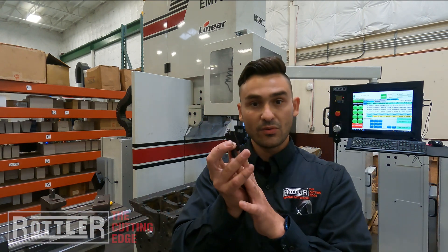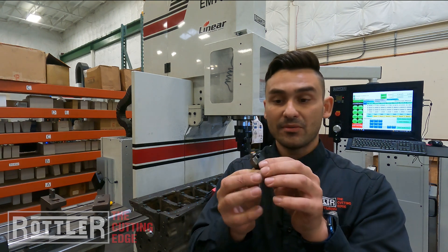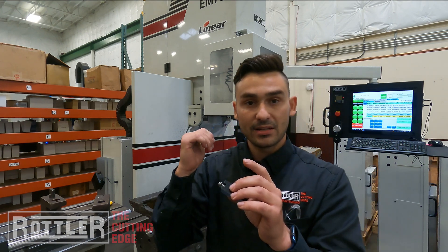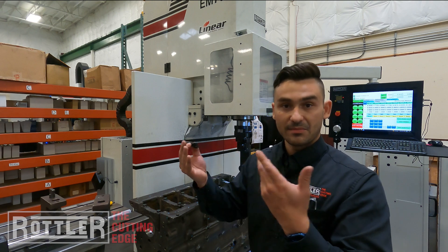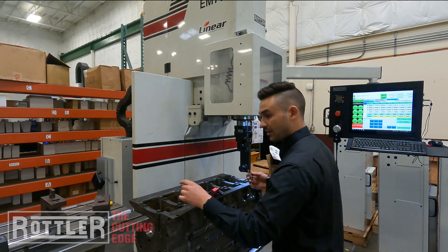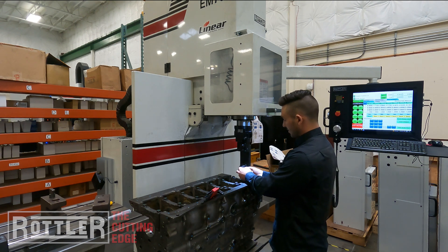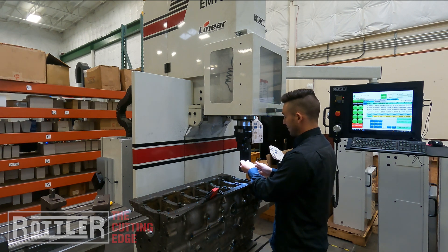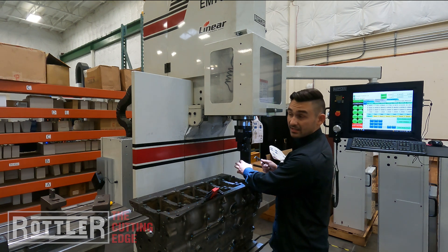Now when you go to put these into the right-angle drive — just as well as our boring heads — there's a little spring post on the back that we used to adjust it to the diameter you want. Be careful when you put this into the tool itself, the right-angle drive, because if you push this in too hard you're going to compress that and you're going to be cutting significantly undersized from where you are. I always like to be real careful and just slide them in until I feel it touch — a little tension on there. Sometimes you can even use your thumb to brace against the cutter head body.